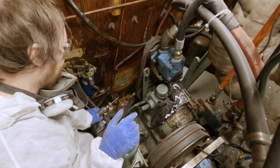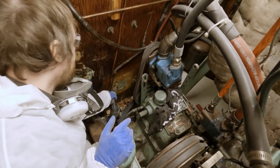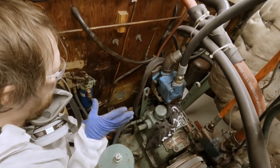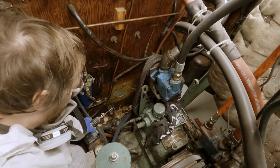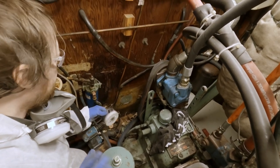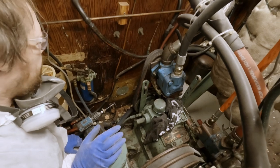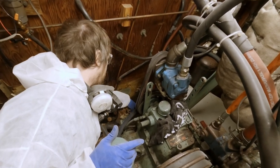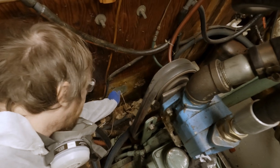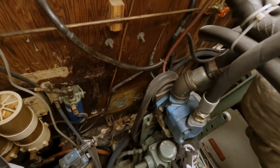Behind the main, just fixing to drill a hole through this bulkhead again. We plugged it a while back, filled in all that - it was a pretty ragged cut through there. Just kind of cleaned it all up, put in a new block of foam, and we're going ahead and cut it out. That's going to punch through with a three and five-eighths inch hole saw, which will give us clearance for the packing gland that's also going to be mounted on there. I still have a line coming off the coupler right here, so I just kind of pulled it tight to where that hole is, more or less the original hole, and got this angle - it's not quite a 90, it's just slightly off of a 90.